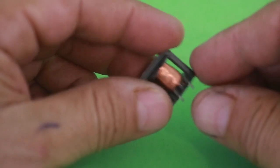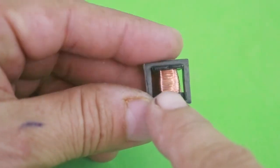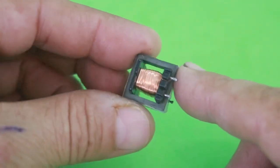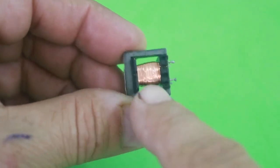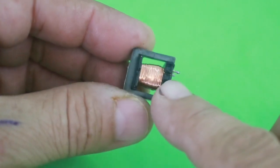This is the little inductor. We have only a single coil and in order to make it a transformer we need to wind a primary. We will use the original coil as secondary because it has a lot of turns.